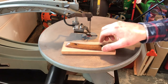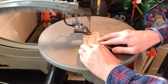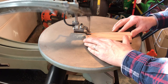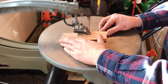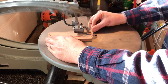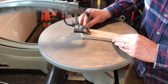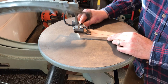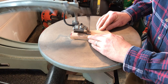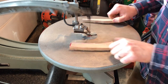Over to my 1980s Delta bandsaw — this project had me using some tools for the first time, this being one of them and the router being the other. I traced out the handle and tried to cut it as close as I could, but it proved difficult to match it up that way. What I ended up doing later was cutting the handle slightly bigger than needed, bolting it to the axe, and then grinding it to size — that worked a lot better.